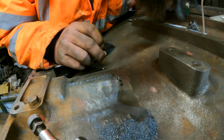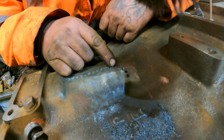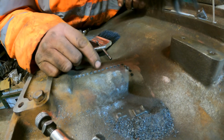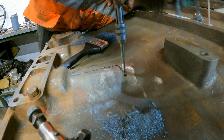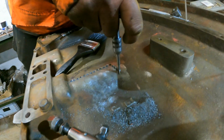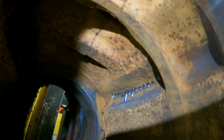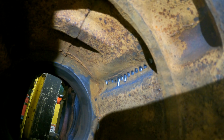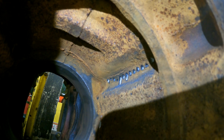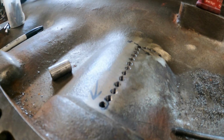What we've done as well is we left this corner one untapped. Then this is what we use for picking up our in-between holes. And including the thread, that gives us a 60% overlap, which apparently is the optimal number. Now, because we're drilling cast iron and it's a through hole, there's no point backing off. There are no chips to break. We are right against the edge of a web on these. So that is all of our holes, and they have now been threaded.